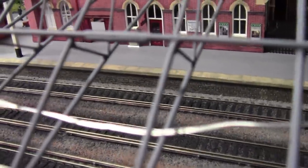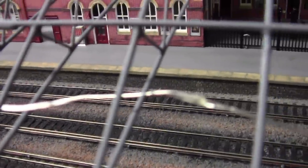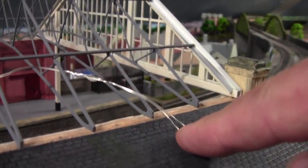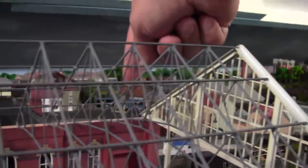What I'm doing at the moment is super gluing this fine wire onto the trusses with the LEDs pointing down. I'm having to twist the wires each time and trying to keep them as straight as possible - they're a bit wavy at the moment, but hopefully by the time I get to the end they'll be nice and straight. Then I'll be able to solder some more wires to the end. I'll feed the cables up the inside where you can barely see them, then bring them back down and run them down the other side.